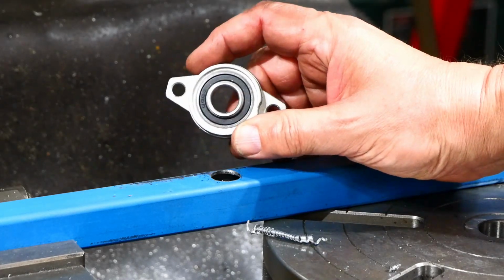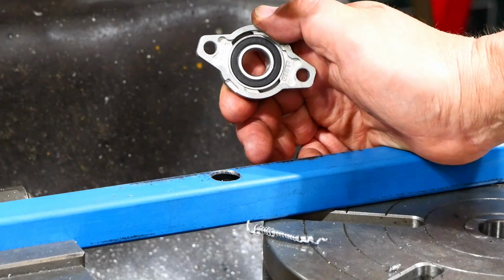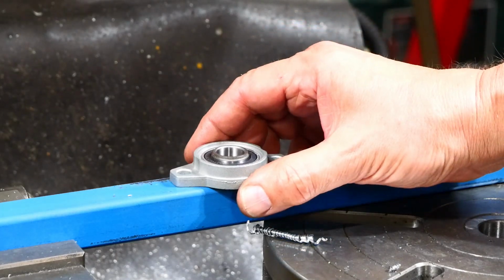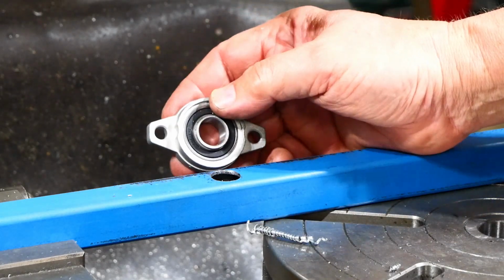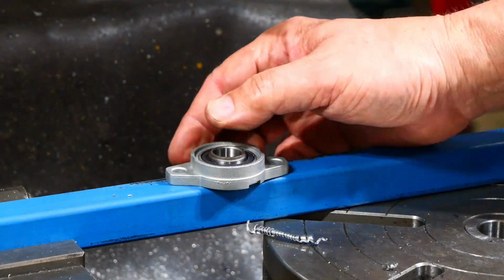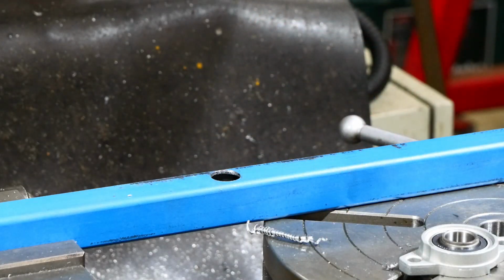So I've got these little bearings. I'm not sure what they're left over from. I think I bought them for something. Well, I did buy them for something, but I can't remember what now. Didn't use them. Anyway, perhaps not the ideal choice for this, but I've got them, so I'm using them. So they get secured by 6mm bolts at 53 centres. So I don't know whether I've got enough room here for that drill. Well, we'll find out.